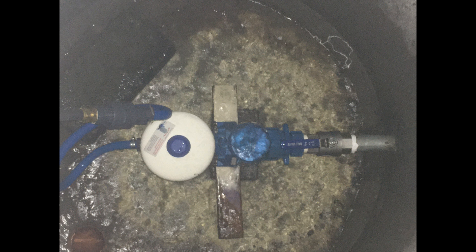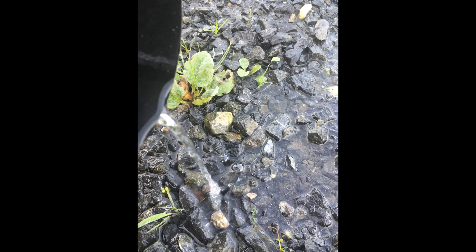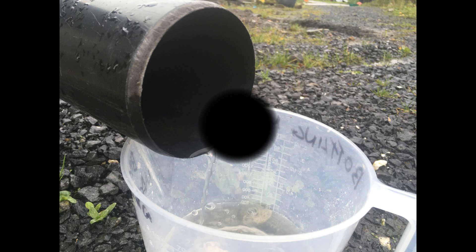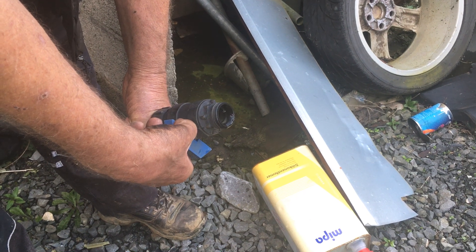We now fitted the pump, plumbed it into our existing delivery pipe, opened the ball valve, and the pump immediately started to pulse and work. We checked to see if we had a supply of water up to 50 foot to our storage tank — we did. We measured the amount: approximately 1 litre per minute — 1,440 litres per day. Success!